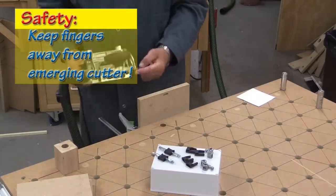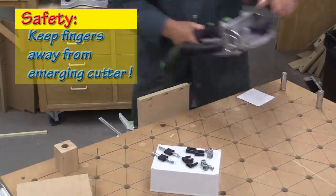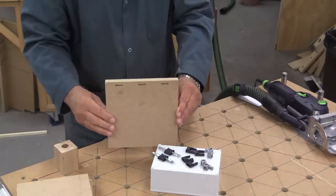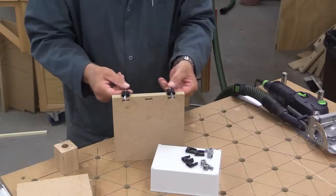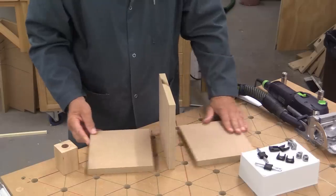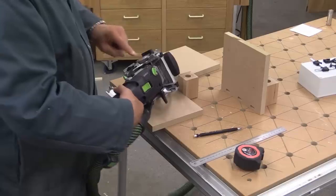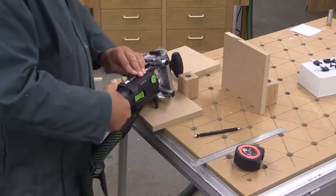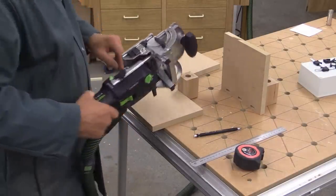Now for these end twos, I'm using the paddles. So there we have those domino holes going all the way through. And it's through these, at either end, we'll put these two anchors. Now we're going to tackle the pieces that come from each side. This time, the domino setting still has 10 millimeters on the height scale here, and this time I'm putting the depth of cut here to 28 millimeters.